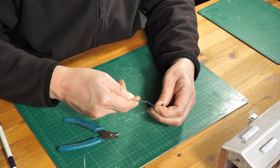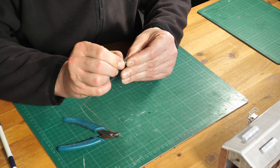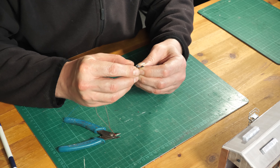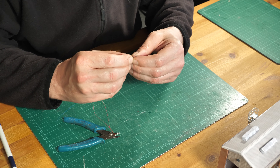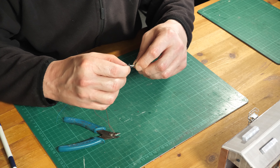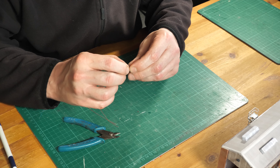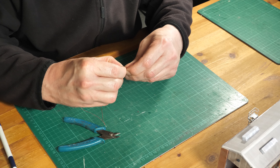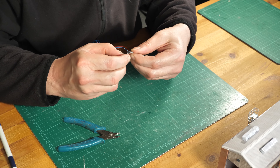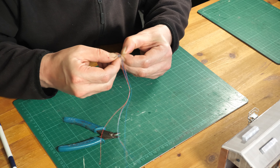You've got to be so careful not to break the wires. One of the ways I tend to find is you can pull the tube out and then start to break the plastic off — you really have to be as gentle as possible. The worst thing is if you've spent all this time and you break one of the wires off the LED; they're not very easy to solder back on — they're very much like surface mount LEDs. But if you've got plenty of these lights it's not a major issue. Just be careful with the super glue too — you don't want to glue the housing or any wires to it.